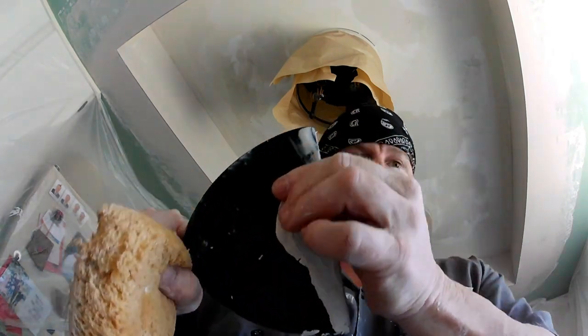Mud. So I took off a lot of extra mud. That's first coat slicked out. I don't know, first coat slicked out looks better than most guys' third coats. So I don't want to keep putting mud on here. I don't want a big hump on here. So I'm just going to go through now. I'm just going to touch this up.